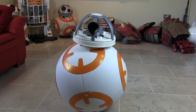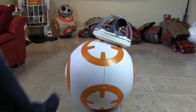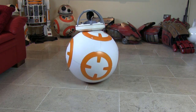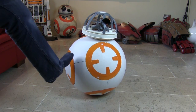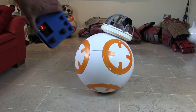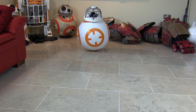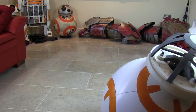I just wanted to show what difference tuning that PID controller has had. So if I give this a kick now, it pretty much sorts itself out by the time it comes back to the middle. There's some oscillating there, which is just the head fighting the body — I probably need to configure a dead spot. If I turn off the motor controllers and give that a kick, obviously what we get is a big unstable wobble, which is why you really need the software and the sensor processing to stabilise it.